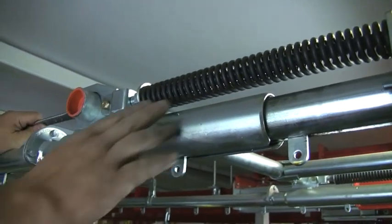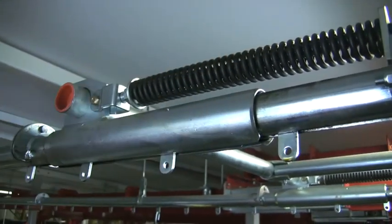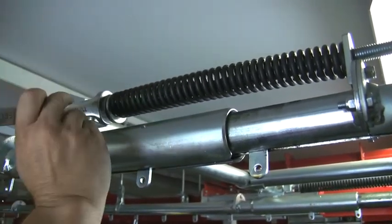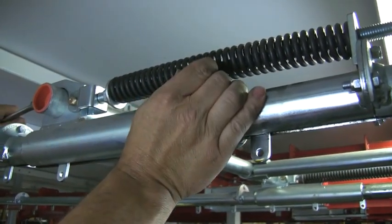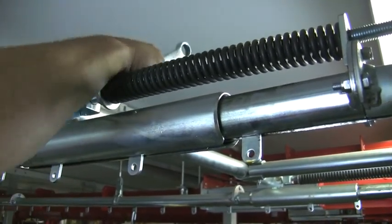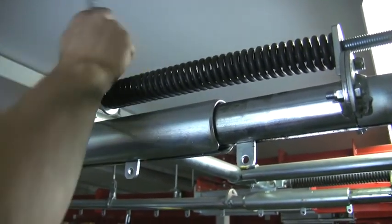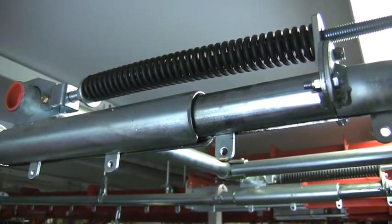What's the proper amount of tension? I usually go and rotate this. This one could actually be a little bit tighter — I can turn this nut, compressing this spring a little more without any problem. You never want these spring coils to be touching each other, because that would mean it's completely solid and you're putting excess pressure on the conveyor chain causing undue wear. I can see by the tension on that chain that it's pretty good.